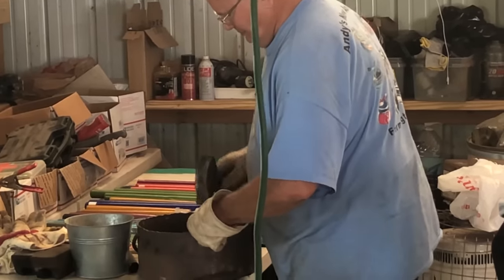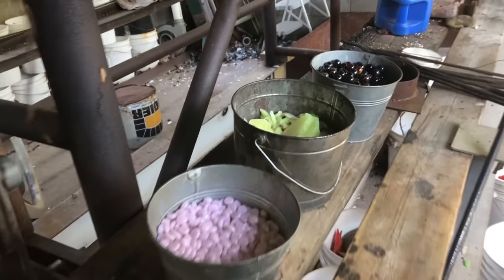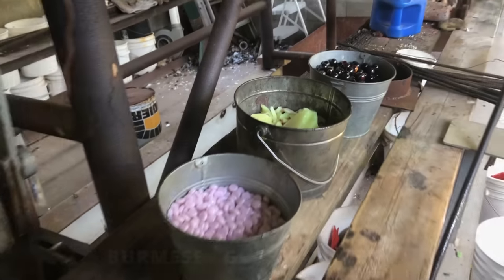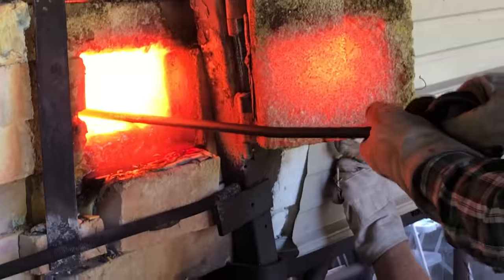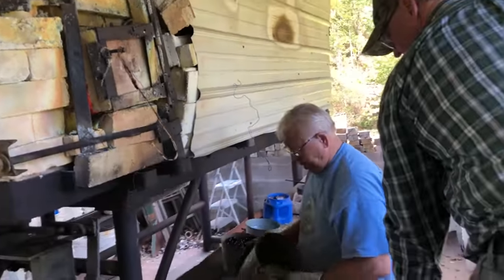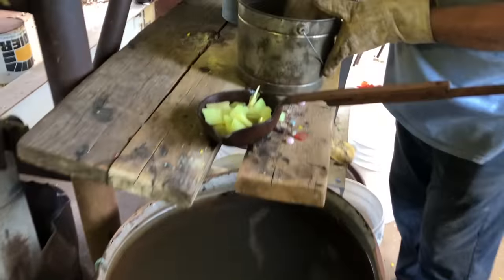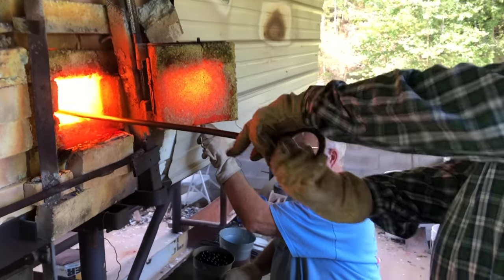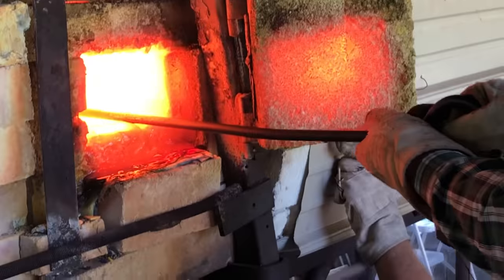Dave's breaking down some premium color here into bite-sized chunks, and he's prepared this color combination for this leg of the run. He's got a bright pink, a yellowy Burmese glass which is highly UV reactive, and a transparent red color — with a little black light to show it off. The door goes open and in goes a few pounds of color, a few scoops of each. Some scoops are positioned far across to the other side of the orifice and some are dropped right near the port. This colored glass won't mix in with the base glass like paint — it'll melt down and create its own distinct stream, working its way down into the orifice. Looking at a photo of the inside of the tank, you can see how stream channels begin to form in the tank floor where the glass moves quickest, and this is basically how separate swirls are created in your favorite marbles.